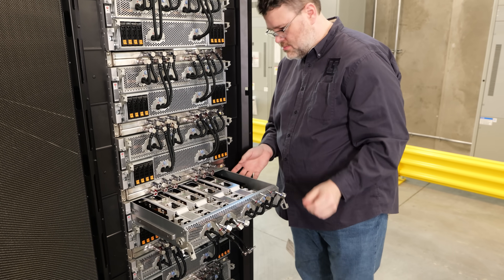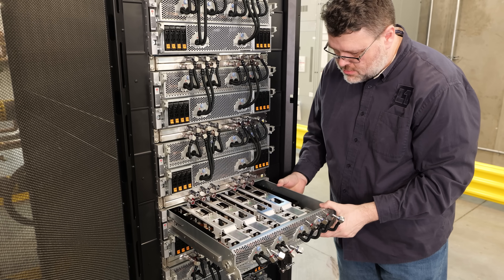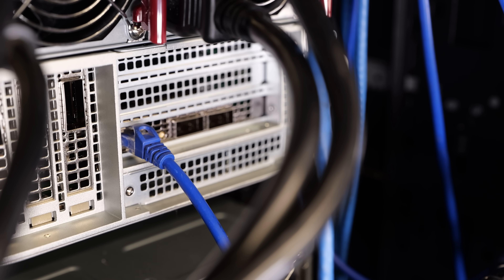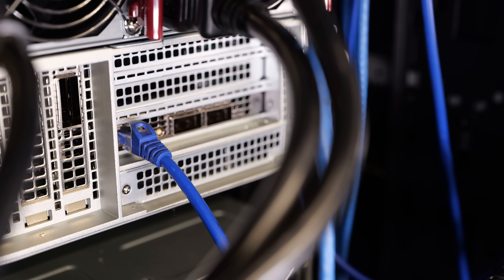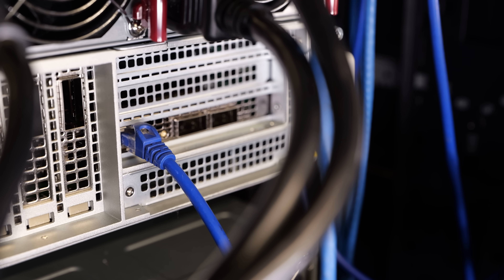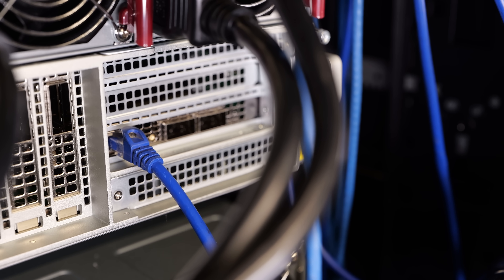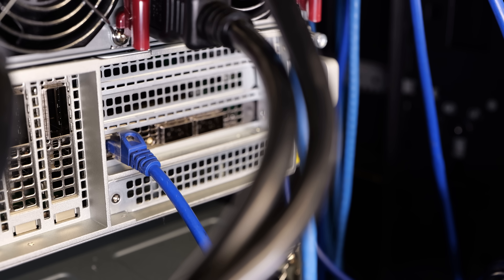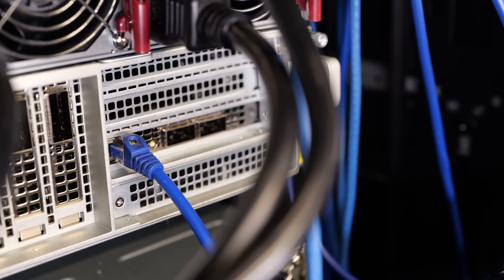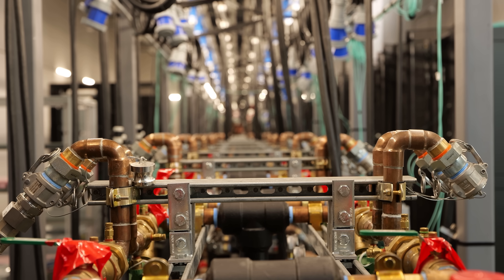At 70 kilowatts, when you're using liquid cooling instead of air cooling, if you don't have to run that many fans, you're saving a pretty significant amount of power. There are eight connectors at the back of the system, eight systems in the rack, and eight H100s — this is not a coincidence. Every node is directly connected to every other node, which minimizes latency and lets you build an eight-by-eight grid of H100s. That is a lot of bandwidth from every node to every other node.